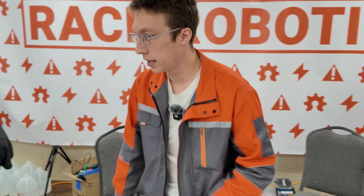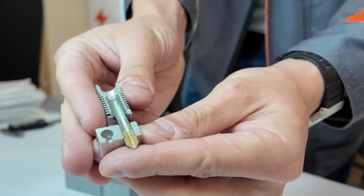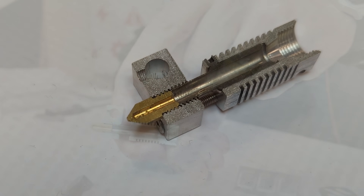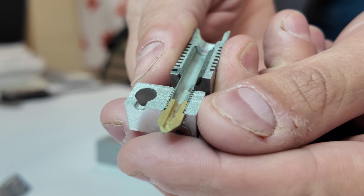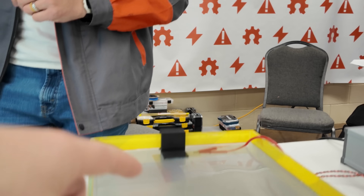Here's something we've machined with this. This was done on the Ender 3 — we put it in a 3D printed jig and cut from nozzle back to the end of the heat sink. It can cut through multiple different material types at the same time, of multiple different thicknesses. Pretty much you can cut through anything that's electrically conductive — we've done everything from aluminum to tungsten carbide. And obviously we have water here.